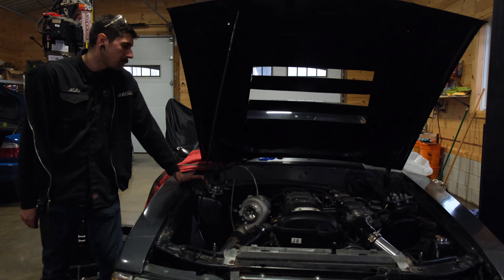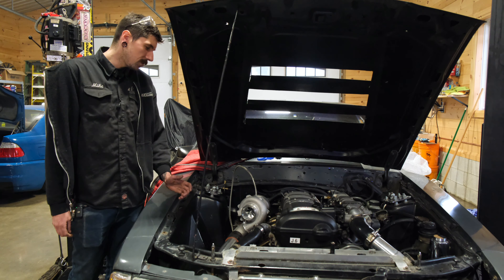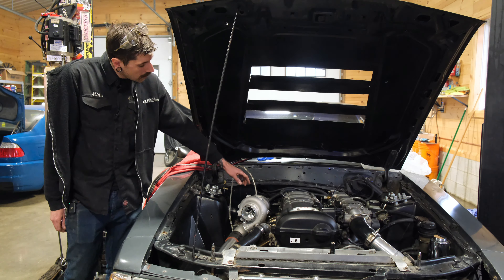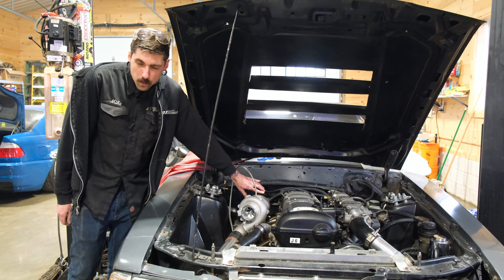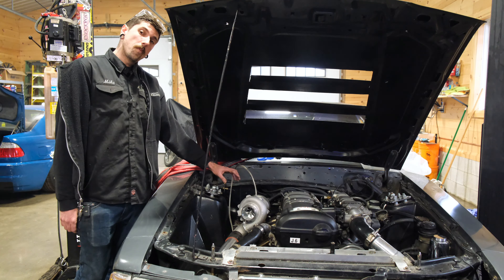Already we can tell off the first bat it's on a cool angle. I always like the little angle on the turbos, it looks cool — it's kind of a flex. So we're gonna have a small little 25, 20 degree-ish coming out, pop a 90 down, leave room on the waste gate.